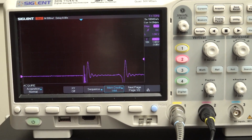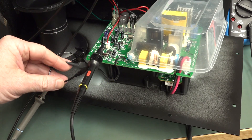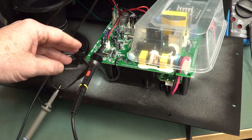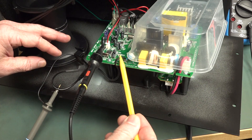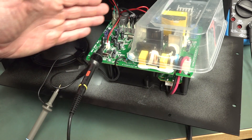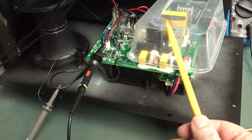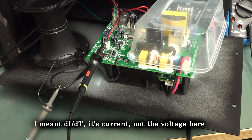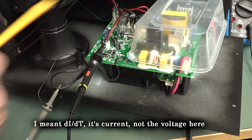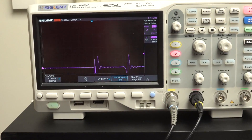We're still not seeing what's going on, but where's all this funny business coming from? Well, if you're experienced in probing you'll no doubt see where we've come a gutser here. Look at this big antenna ground loop on the probe - we're being lazy in our probing. We're just probing a power supply so we don't necessarily care that much about high-frequency signal integrity. We've got big mains magnetic stuff in here - big magnetic components inside here. When you switch on there's lots of dV/dt, the change in magnetic field which then couples into your grounding loop. That's being picked up. So poor probing explains why we'd get stuff on there, but it still doesn't explain why it triggered at that point when our trigger level is up here.